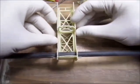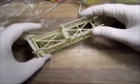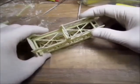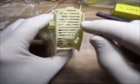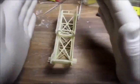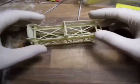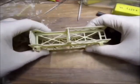And there's another thing I noticed, the slight wobble. I think it's because these two plates, once you cut them manually, have this tiny half a mil there, or half a mil there, and it's twisting that way, so the frame is not perfectly aligned, it's not perfectly square.